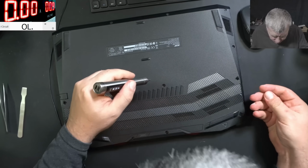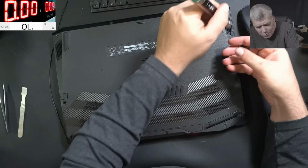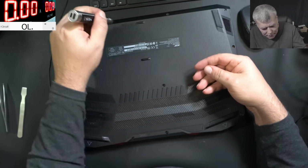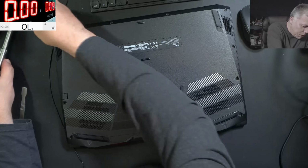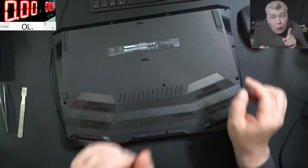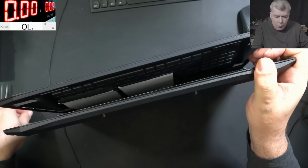Most likely, you know, what can smoke there? 19? Nah. Probably the 19 smoked with the tracks from the chipset. Yeah. And that's the reason why the laptop is not coming on. It's not because the main power is shorted. No. But we can check that.